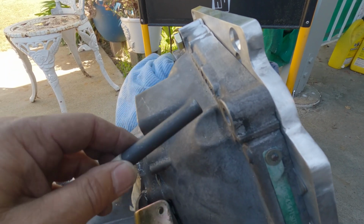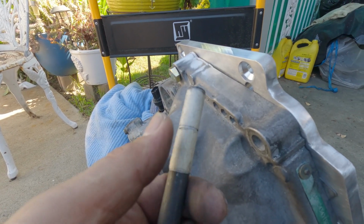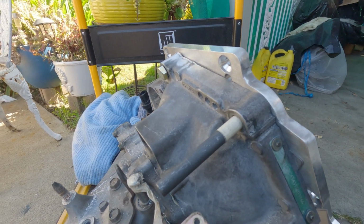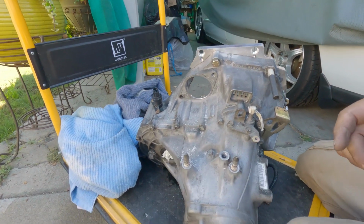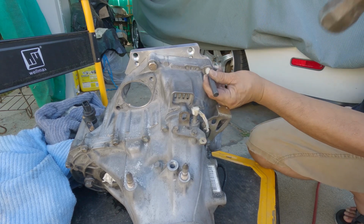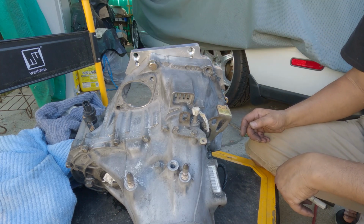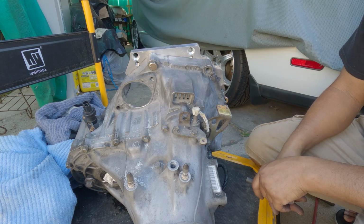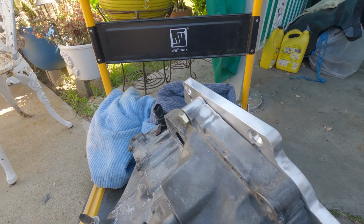My center punch is a little bit too loose. So in order for me to get it really centered, I just wrap some tape over it. And right there. So I'm getting ready to put some dimple on there. Let me get set up. All I need is just a little, right there. And I'll be doing the same thing. Drill it, put some helicoil on there, and I'm good to go. Huh. That wasn't so bad. Something new, something different. Yeah.